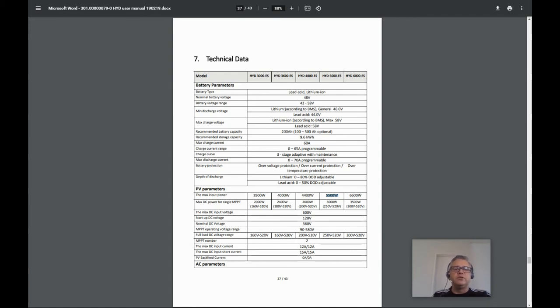7,840 watts can be connected to the inverter to allow for the solar panels not generating at 100% the whole day, but you can't exceed the maximum PV voltage or current rating listed in the inverter specifications. So you need to check the specifications on the solar panels you plan to use to keep the quantity of panels within the inverter specifications. You'll also need to consider if you have sufficient roof space to fit the solar panels to be able to generate the power you need.